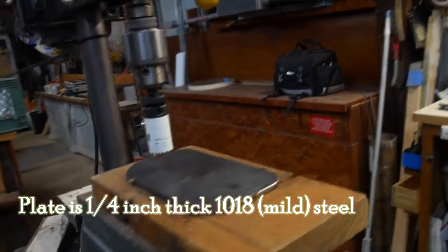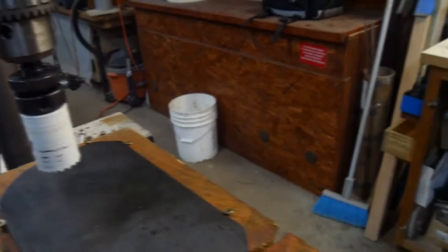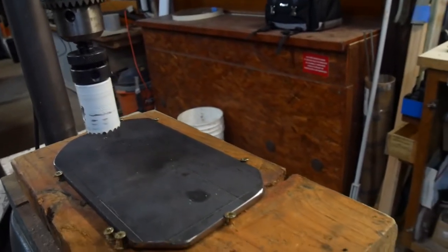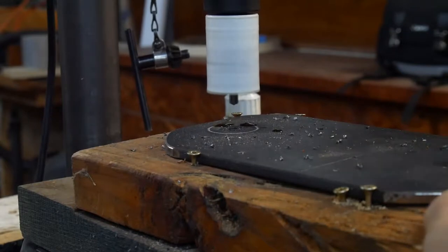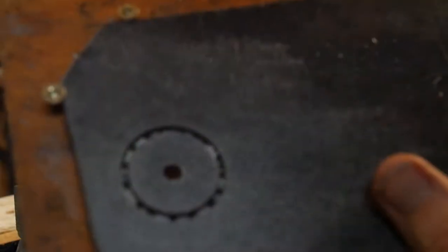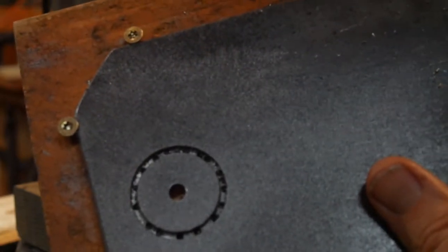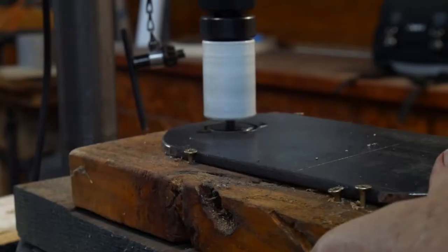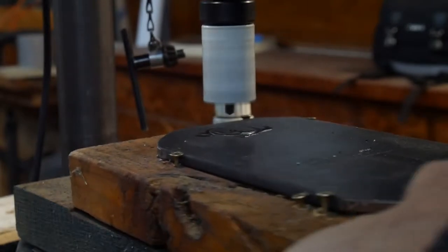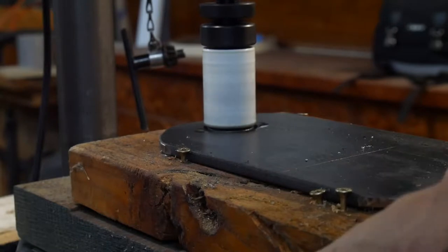See what we've got chucked up in the drill press — we've got the plate. I'm going to bore a hole in here, 1-3/8 inch for the bushing. I have it secured to a piece of 2x, screwed down on the four sides. I've got cutting oil on it. I've drilled a bunch of holes around the perimeter of the circle, small holes the width of the kerf, to see if it makes the boring any easier. Now if you've got a drill press more substantial than this — this one the belt slips, it's only a third horsepower — if you had a three-quarter horsepower it could throw the workpiece and hurt your arm. You need to really bolt it down.